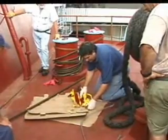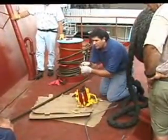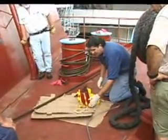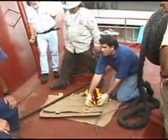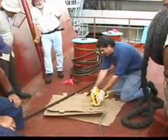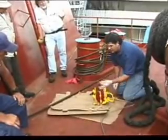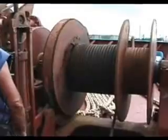All right, don't tighten these down before you clamp this thing onto the rope. The holes right here are oversized for the bolts. So what'll happen is, if you go tightening this down on these scrapers, you can tighten them down so that the scraper's pushing too far that way. And you go to tighten it down, and it won't tighten all the way around the rope, because it's hitting here first. So these are the last things you tighten.